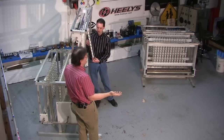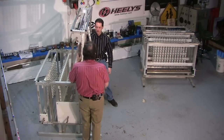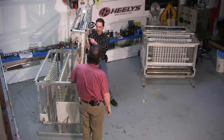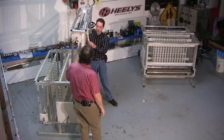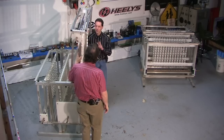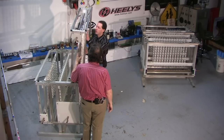We have a bunch of spare strings. So you could grab one, pop it in. The string is a complete integral unit with the safety resistors mounted on the other side of the plastic, so that gives us voltage isolation. There's a 1/4-inch thick piece of acrylic. So we've got the capacitors here wired in series, and then paralleled across each capacitor is its own individual resistor. That way everything is zeroed out in just a matter of seconds, and it's all happy and wonderful.